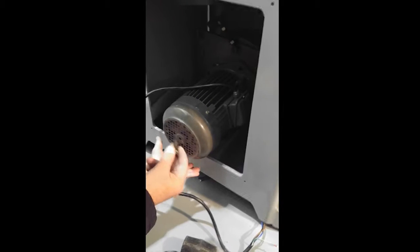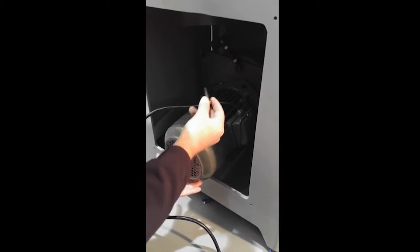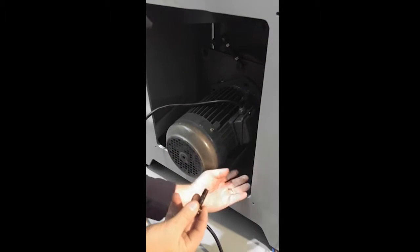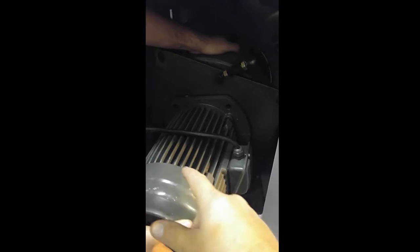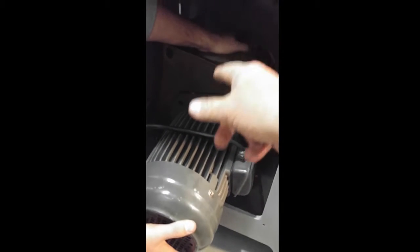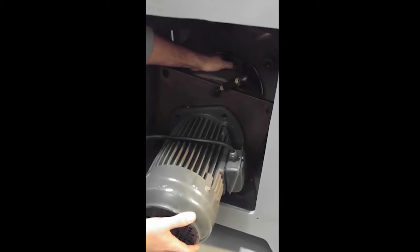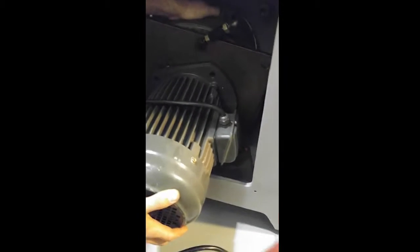Okay, when you pull this bolt, this is what is holding the tension of this mounting plate. As soon as you pull this out, it's going to go down. You don't want your hand underneath this motor when we pull that out, because that's holding the support of the motor. It's going to come down and pinch your fingers, and that's not going to feel very good. So it's pretty much a 2-person job. You've got the mounting plate and the flywheel all trying to come out at one time, so you want to make sure you're ready for it.